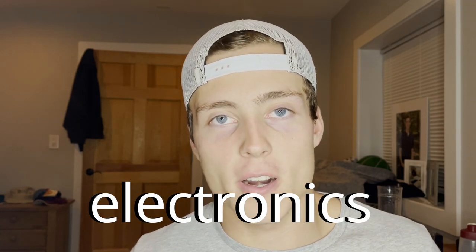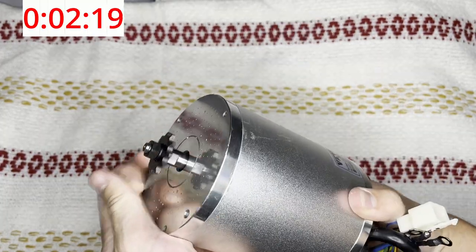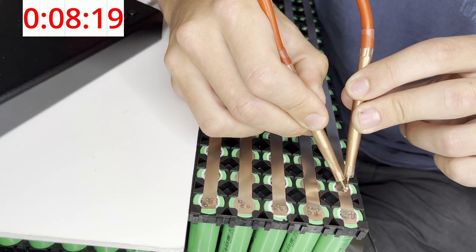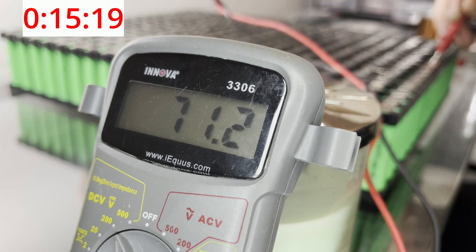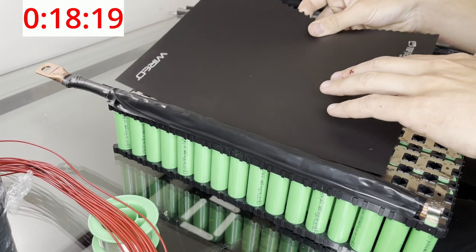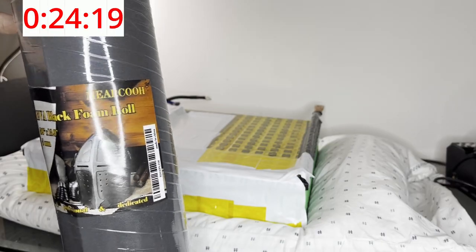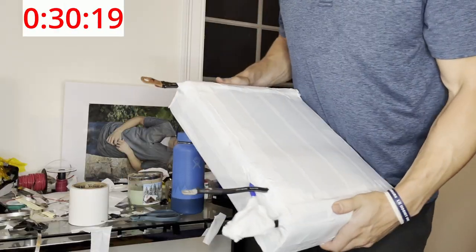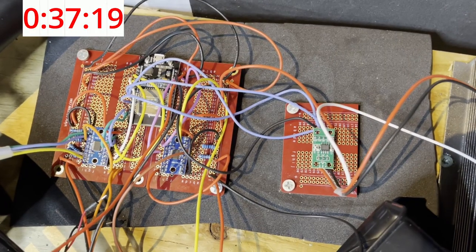Now a quick overview of the electronics in 45 seconds. The couch is powered by two motors, each controlled by an electronic speed controller. To power these motors, I built a custom battery using 320 18650 cells, all spot welded together using nickel strips. The final battery has a nominal voltage of about 72 volts, a capacity of about 40 amp hours, and 150 amps max current draw. The battery management system has safety measures to basically prevent your battery from exploding — because that does happen. A little foam for protection and tape for waterproofing, and the battery is complete. The battery also powers the horn, underglow, and steering. This board is the brains of the couch and is what allows me to control it with a PS4 remote.